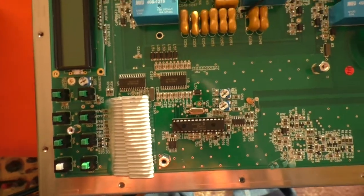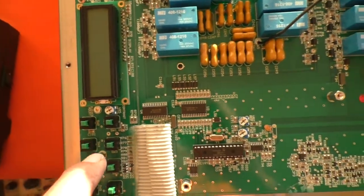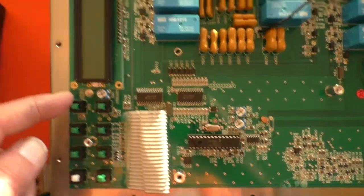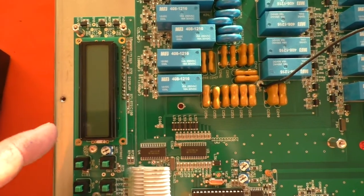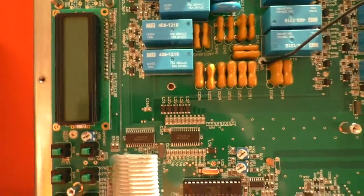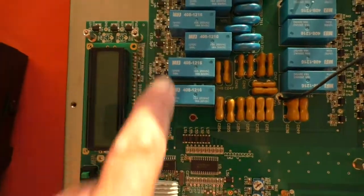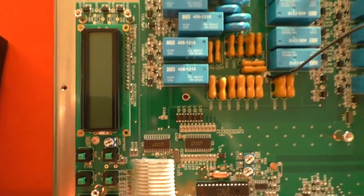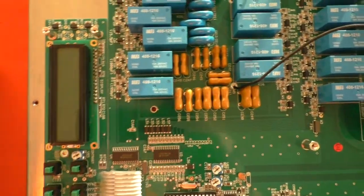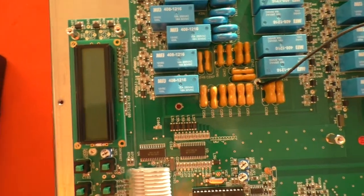Now, they've got the control part here just as you would find on the 998 non-RT version. These buttons here do exactly the same as the buttons on the front panel of the 998. This one here is the mode button. What I might do is select this to show what values of L and C it's using to match a given load, then turn the power on and off a few times and see if it stays in that mode. If it does, I think I might cut an oblong window in the cover and put a clear window in there so that when it's achieved its match I can actually see what values it's using. That could be useful if I wanted to make a fixed match for a given band or a couple of different bands and remove the tuner and use it for something else.